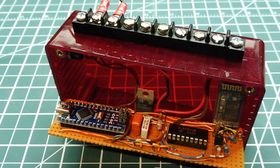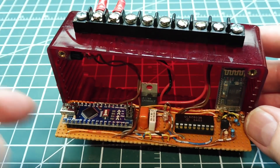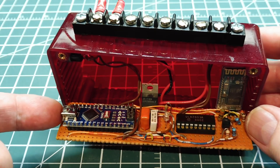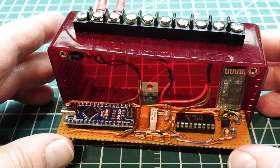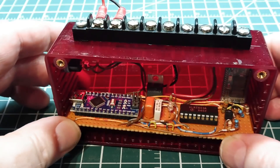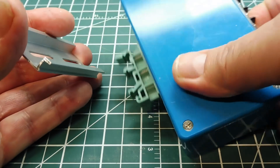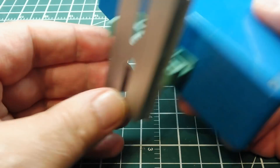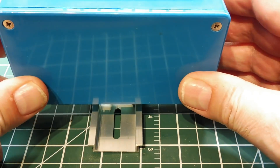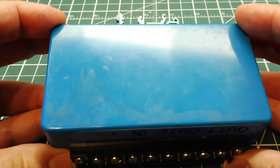When I go to mount my control box, I usually use a DIN rail. If I mount this on a DIN rail, it's easy to snap off and bring to my bench. I can actually power up the whole system through the USB port on the Arduino Nano — I don't need an external power supply. Here's another box that has a DIN rail mount. It basically just snaps in — two slots, you can mount it anywhere. To take it off, just release it from the DIN rail, put it on your bench, and you can work on it.